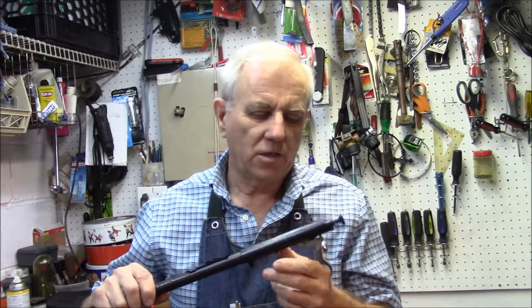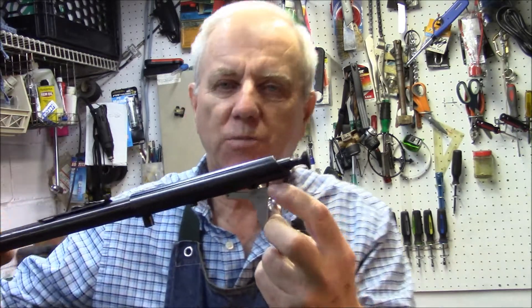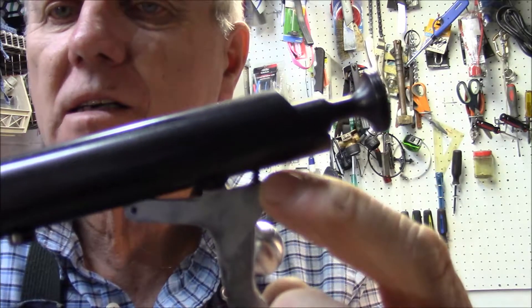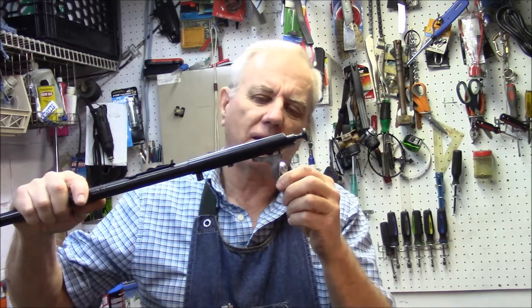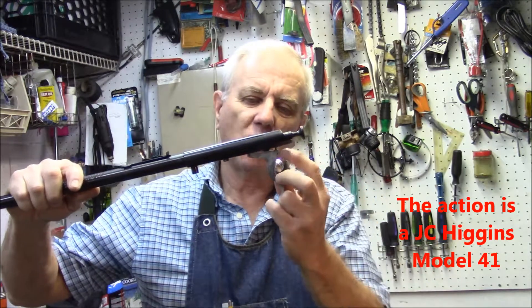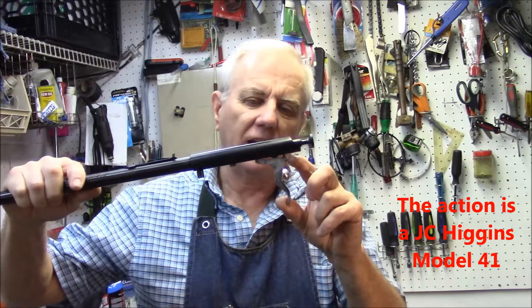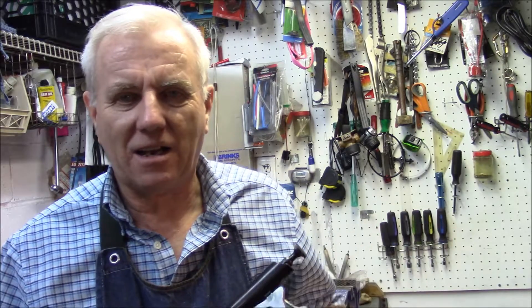What I'm going to try to do today is make a spring on the lathe. The spring is going to replace this trigger spring, which is about 1/8 inch diameter and the wire diameter is probably about 20 thousandths. The trigger pull on this barrel action is very hard and it's mostly caused by that heavy trigger spring, so if I can get a lighter trigger spring it should lighten the trigger pull. I can't find this spring commercially - there are some made in China but I don't want to buy from there, so I'm going to attempt winding my own spring on the lathe.